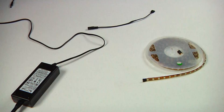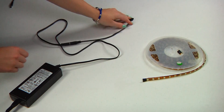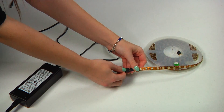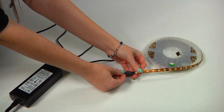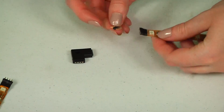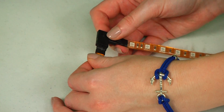So with that in mind, let's get to putting the single-colored tape light into action. First, you want to plug the LED driver into the power connector cord. Then, you want to plug the other end of the connection cord into the colored LED tape light strip of your choice. If the tape light does not light, try unplugging the power supply and switching the polarity of the tape light by turning it over. Corner connectors and splitters can be used when assembling your tape light for a custom fit around corners or hard-to-reach areas.